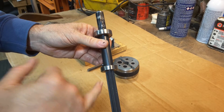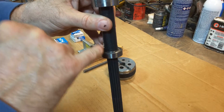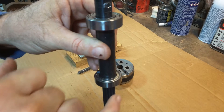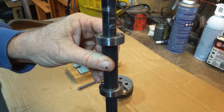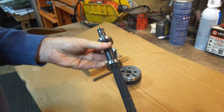In that case, the best you can do is either cut this bearing off totally or drill tiny holes on both sides through the dust guard. You can inject some grease into the bearing with a needle grease gun. So that only applies to the very first year of two-bearing quills.